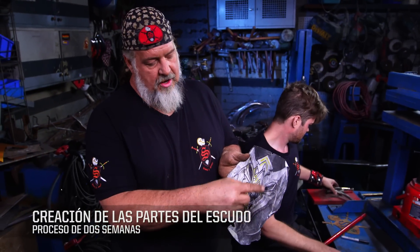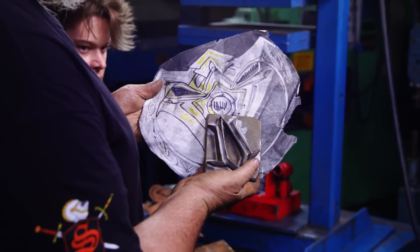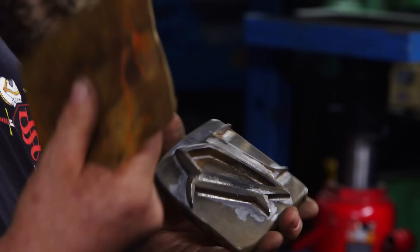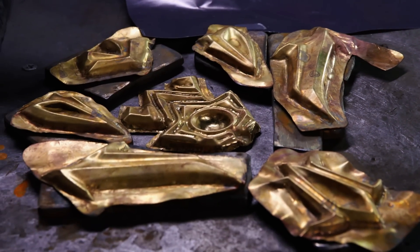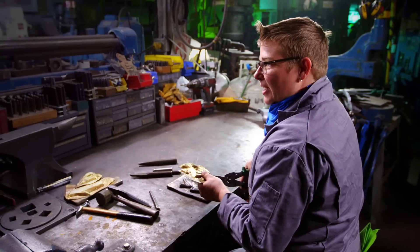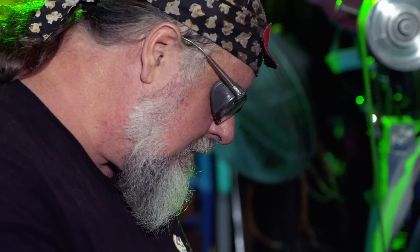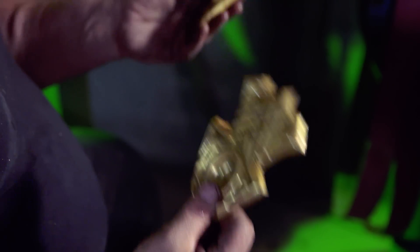On the center portion of our shield, we have 25 separate elements. This element corresponds to the bottom piece that'll go into the hydraulic press, and 100,000 pounds of pressure will squash this into the brass — and this brass will now look identical to this. We've got the freshly pressed brass. I'm going to have Alicia trim it up and match it like a jigsaw puzzle over the center of the shield. Tony will take it to the grinder afterwards to make sure it looks really good. It's hollow — very lightweight brass, but it's going to look like solid thick brass, hence keeping the weight down.